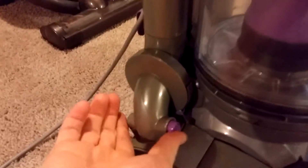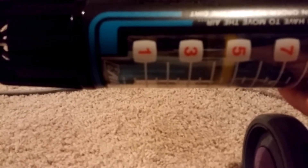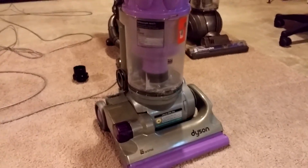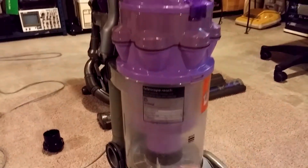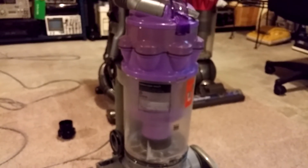Let's now put in the cyclonic bin and see what happens. I can pop this off right here, pop off the Baird adapter, and take a reading — equally awkward to measure, sorry for the jerkiness. After the cyclones we have a Baird 5 reading, and a 5 is 85 CFM. So the cyclones suck down about 23 CFM. It's not as much as I thought it was going to be, but it's still well over 20 — just to separate the dirt from the air, you're losing about 23 CFM.